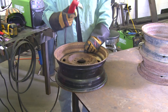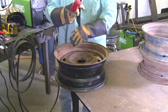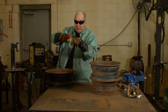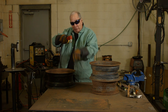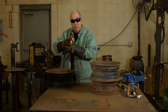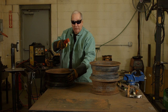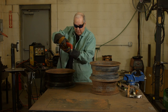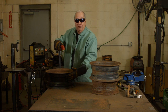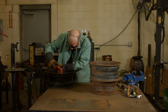I'm about to start the plasma cut. One thing I do want to remind you — we already talked about having a conductive surface — but this comes out as a straight line shot of a hot arc that's going to do the metal cutting. So if you've got your plasma cutter tilted too much, you're going to burn through the side of this, which we don't want to do. We want to make sure we keep it straight up and down so that we're just cutting out the center section without perforating the outside wall.